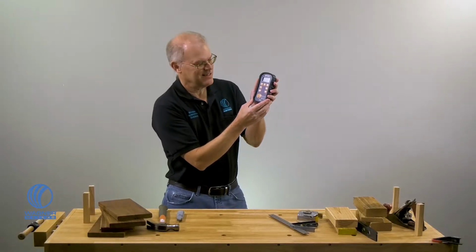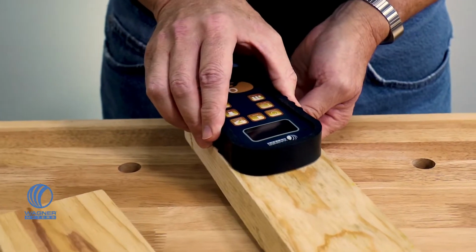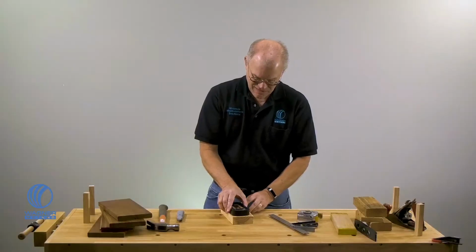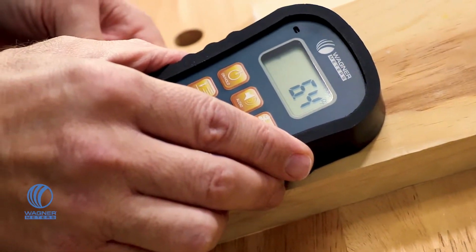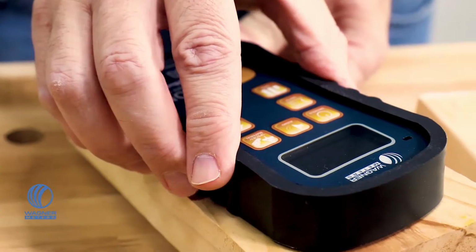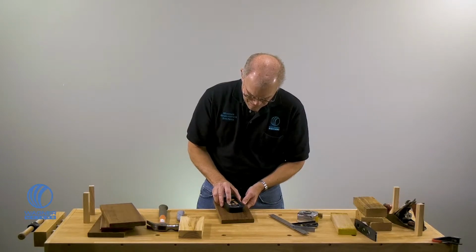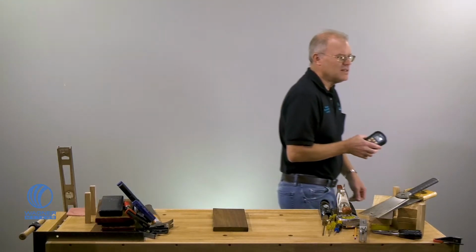A quality wood moisture meter is vital to the long-term success of any woodworking project you put together. The success of your woodworking project, from wood flooring to kitchen cabinets to fine furniture, depends on the correct moisture content levels of the woods you use in the area of the country. Your moisture meter should have settings on it that will account for different species of the wood. For instance, oak is a hardwood, but ebony is an even harder density wood. If you are planning an inlay job using both types of wood, you'll need to know the moisture content levels of each of the two species so that your inlay glue joints will stay intact.